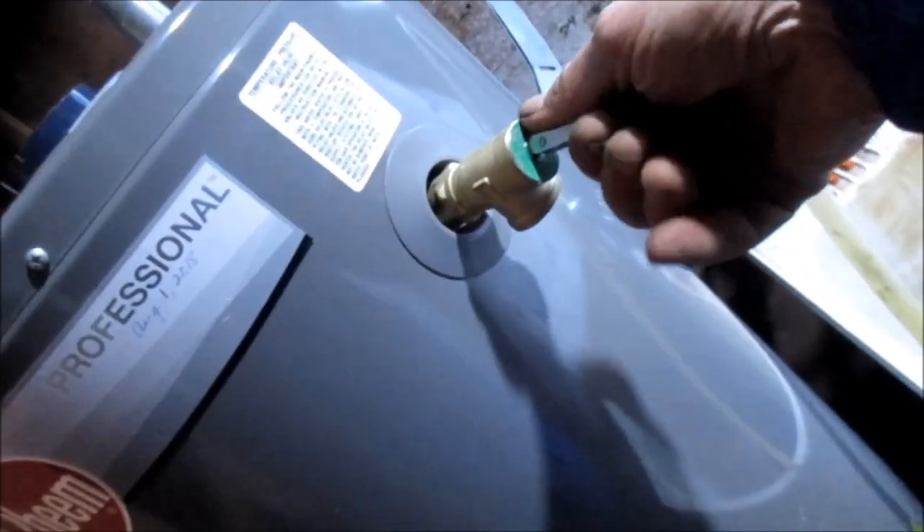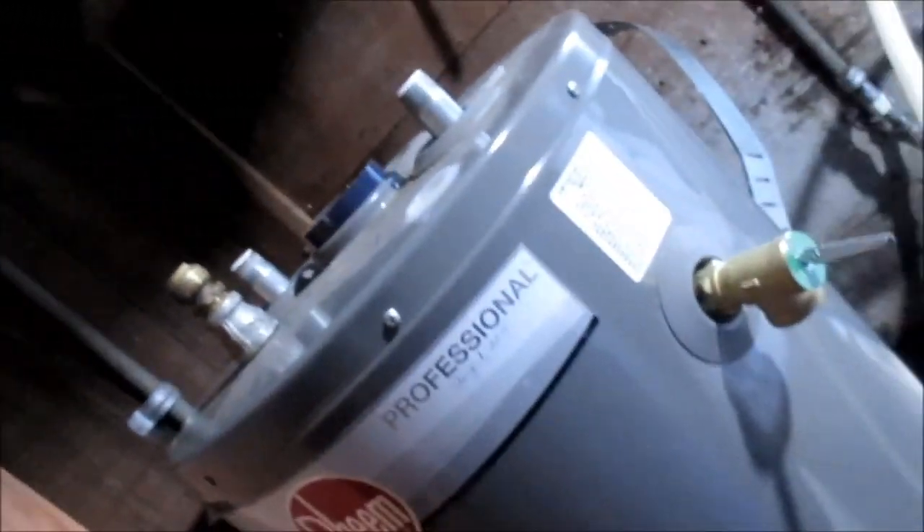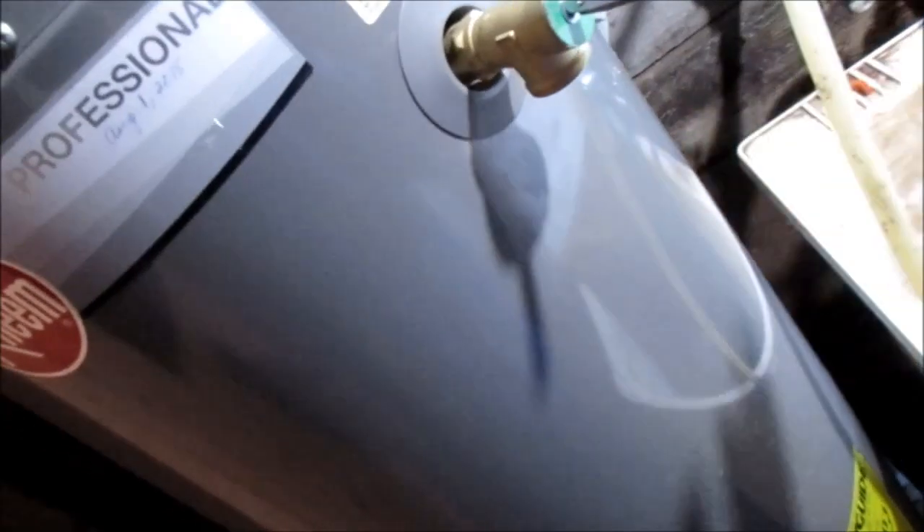This one actually has a sort of drip tube — in case you have any water in your gas, it goes down here. Just have to hook that up. Now we have to open this up, and then we need to prime the tank. Basically we'll prime the tank — leave that open until we hear it starting to come up to this level. Once we turn the water on and fill it like three quarters of the way up, shut that off — the tank is primed.